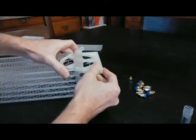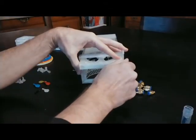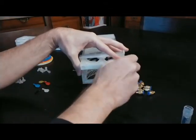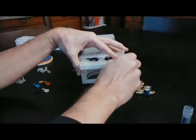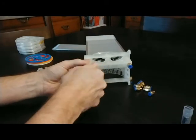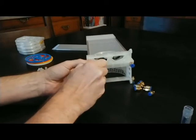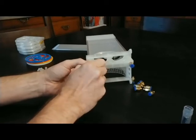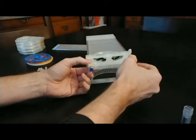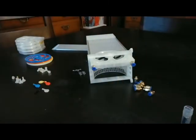The final bit you're going to want to do is get the PTFE quick-release connector in place. I probably just turned that a little too tight — this is a PLA slot for this, so you can't tighten these too tight, but you should be able to get them reasonably tight. If it's too loose, tightening down the top piece may help a little. And that's it. We'll have to assemble four more of these and then we should be able to put it on the back of the printer.